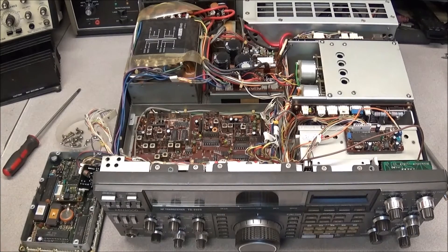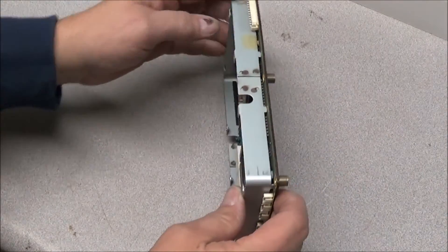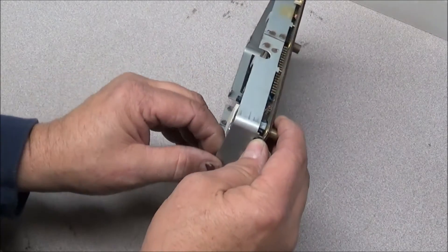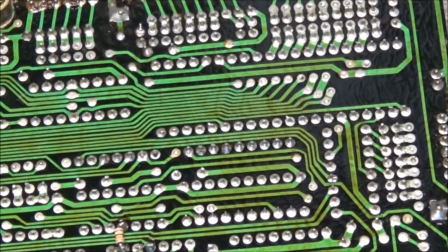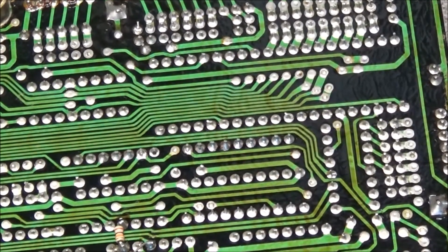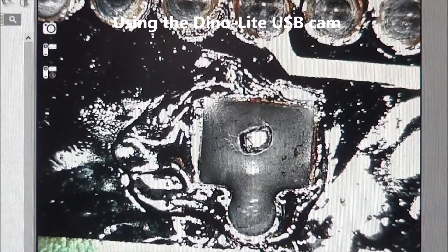The digital unit is now removed and sitting over to the side. To get to the PLL you'll need to remove four screws from the shielded plate and then you can lift it out — and there is your PLL unit. Several things to look for in this radio are these wire connectors; they'll tarnish and corrode and cause a lot of issues. The small coaxial F-plugs will also tarnish and cause issues. But today the main concern is the digital unit. When I removed it, I felt something a little loose on the board.